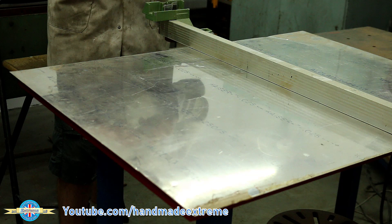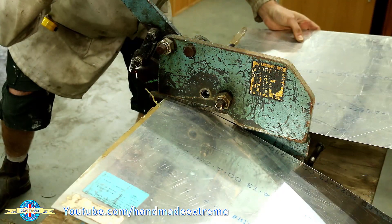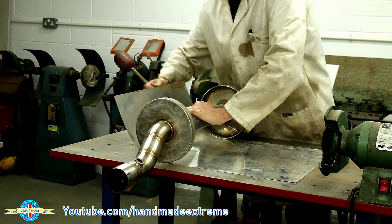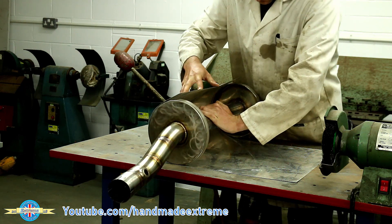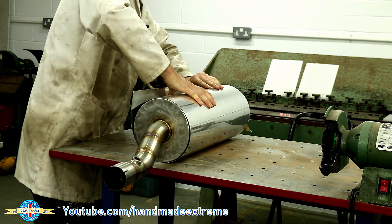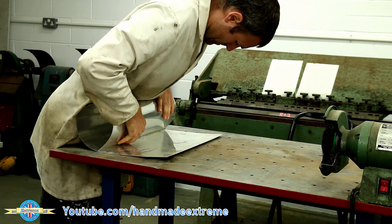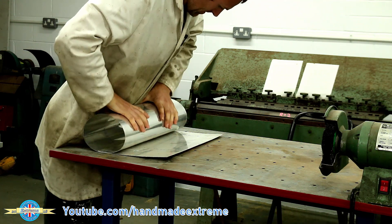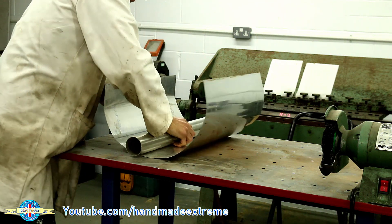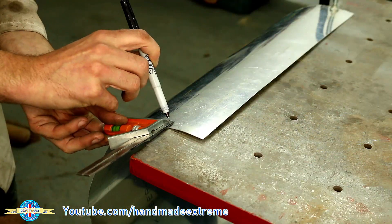For the outer skin I'm using some aluminium sheet — it's actually 2024 Alclad, which for those familiar with aluminium grades is not really the ideal material for this, but it's what I have at about the right thickness. It's a bit stiff so it doesn't really like being formed, and it's a little bit susceptible to corrosion, but being Alclad means it's got a layer of pure aluminium over the top of the 2024 on both sides, which helps with corrosion resistance. The positive to it being stiffer is that it should resist stones and road debris a little bit better. I rolled it up by hand over a bit of stainless steel tube — a set of pyramid rollers would be nice but I haven't got a set, so it was make do.